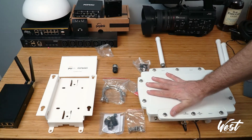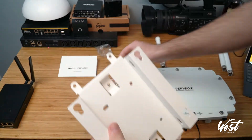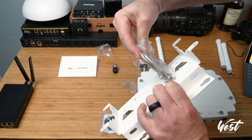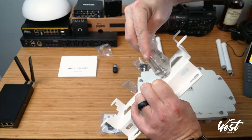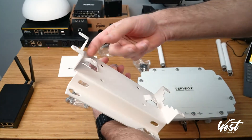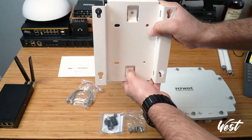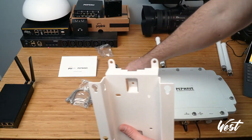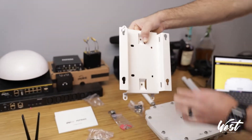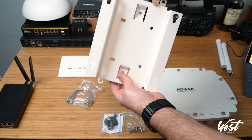To mount this, you have a couple different mounting options. It comes with a mounting plate that supports a pole mount kit that will hook onto these two spots here. So the pole mounts will come in right there, and then you can mount this to a pole. Or you could get some metal straps and slide them through here and mount it to a really big pole or mast. You can also use the anchors that come with it and mount it to these four screws to mount it to a wall. So you have a big pole, a standard size pole, and wall anchors.